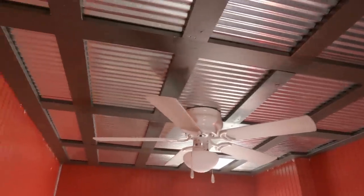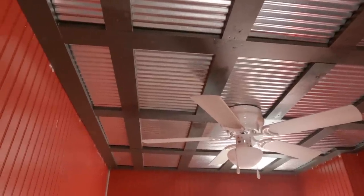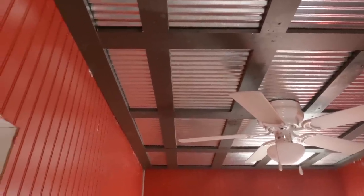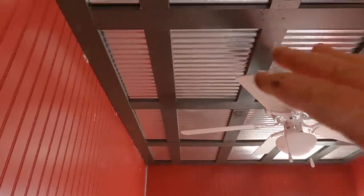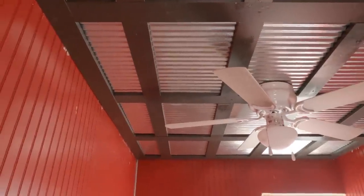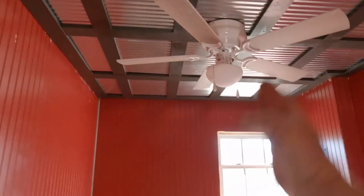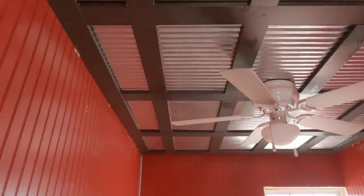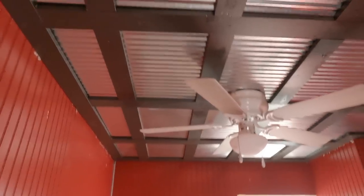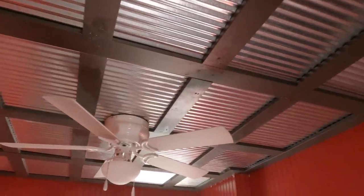In yesterday's video, I was explaining about the squares and the sizes. Let me try to explain that a little easier. If you wanted perfectly the same dimension squares throughout the whole room, then, like, I have floor joists going this way, okay? So that's what I'm nailing to. But you could lay strips, like purlins, across them. Then you could put them anywhere you wanted. But that's an extra expense. It wasn't necessary. I think this looks good enough.